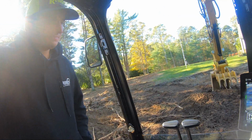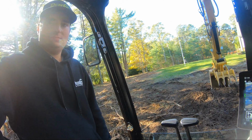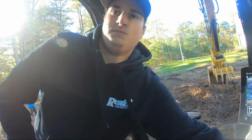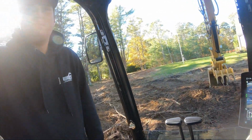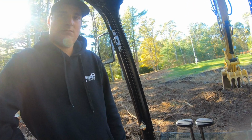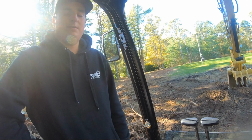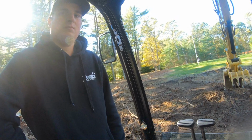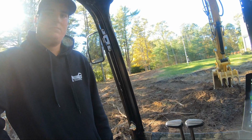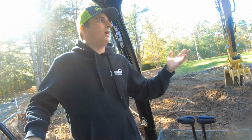Right. So like when I was working with Mike with the 325, what we were doing is we were using a concrete structure, and the corner of that concrete structure was basically our bench point. Exactly. There's no elevation numbers. We were just remembering it. So every time we tracked the machine, mm-hmm, we would just go back and retouch that point. Exactly.